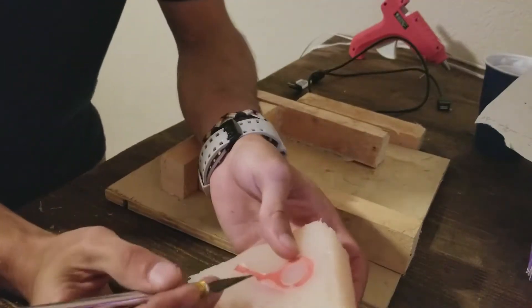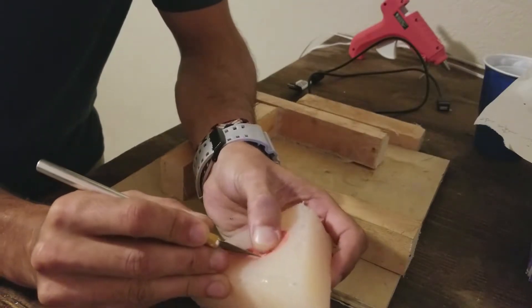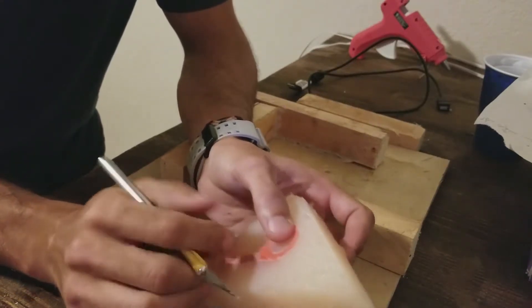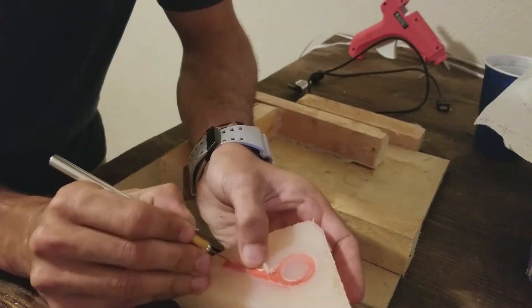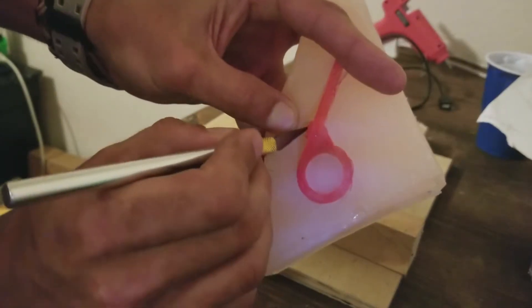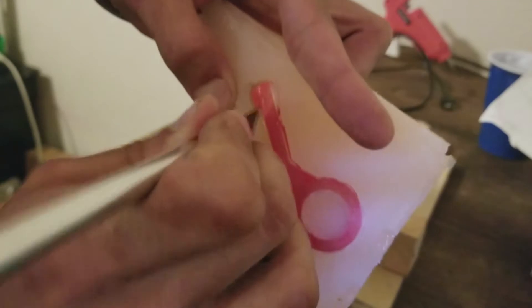After it's out, you can see the part is still encased in there. Before I remove it, I'm going to trim away the little bit of silicone that got underneath and the excess around the edges. I tried just slicing it, but because of how soft this silicone is I had to stretch it before I could cut it. You can see the little screw holes — I'm stretching it away and slicing those off. They'll sit back in place where they were cast, but they need to be loose so you can get the part out and get duplicates out in the future.